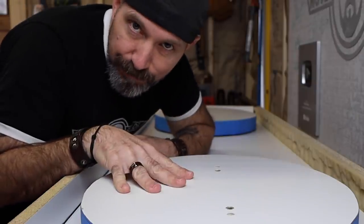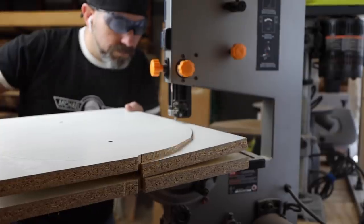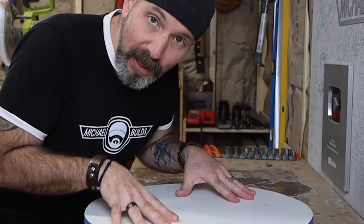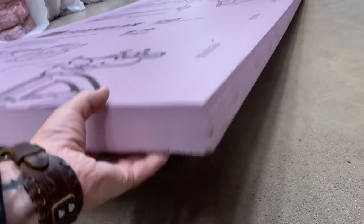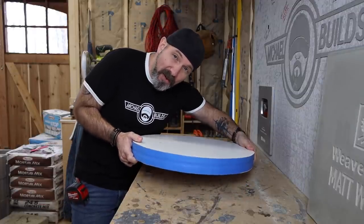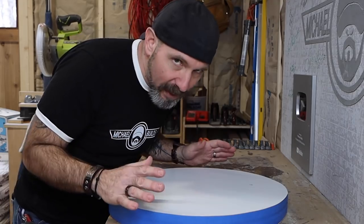As for the knockouts, what I've got going on is very simple. I took a half-inch sheet of plywood and sandwiched it in between two pieces of three-quarter-inch melamine. Then I simply cut my shape out on a band saw, wrapped the sides with tape, and secured it in place. But this is not the best way to do this and not the best material. The best material to use is rigid foam for your knockouts, because I get a lot of emails from people who've experienced cracking in those two skinny pieces in the front and back. That's usually caused by knocking the knockout out unevenly, creating a wedge with too much pressure against the material. By using rigid foam, that takes that pressure right out of the equation.